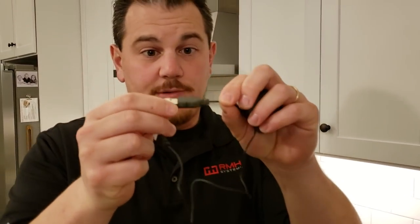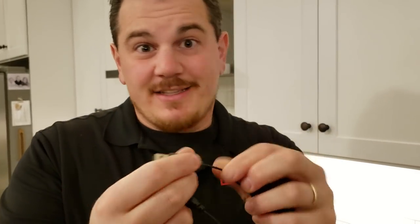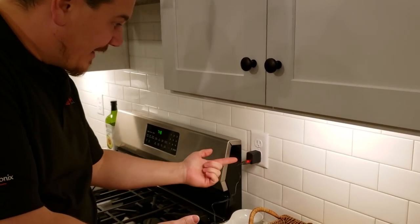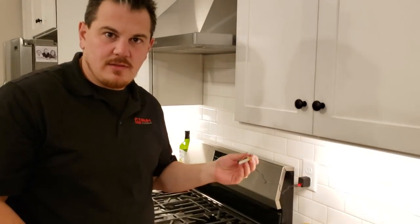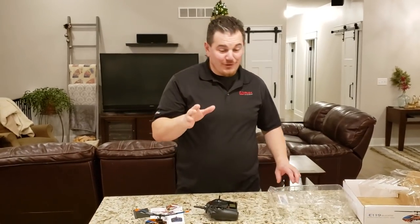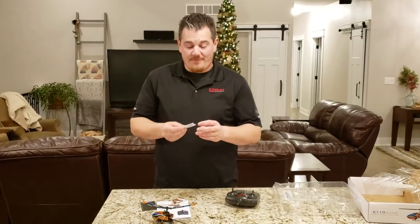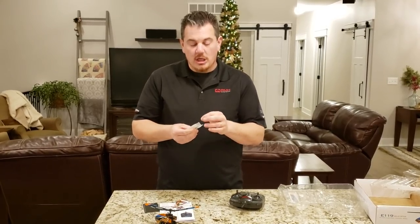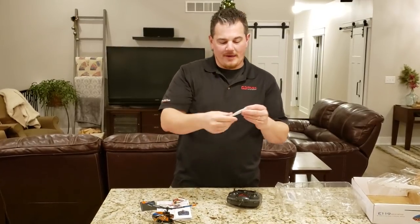Normally I would elaborate on what type of USB charger to use, but there's literally no information on this thing. I'm gonna plug it into the USB port and plug the battery in — there's a red light. Fantastic, that means it hasn't caught on fire. Serious note: LiPos can be dangerous. They are the only thing in this package that could really hurt you. If they're overcharged past 4.2 volts, they become unstable and could catch on fire. Don't be a statistic.